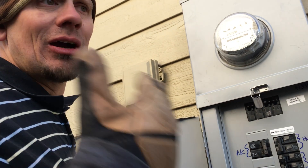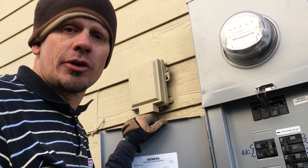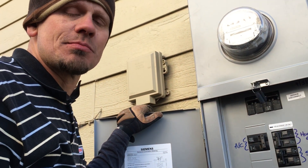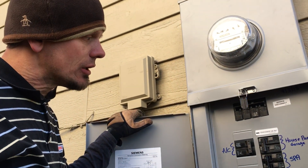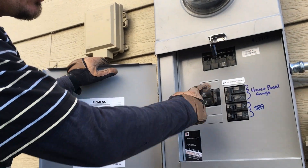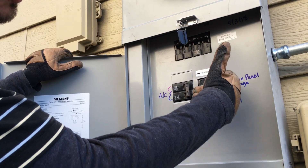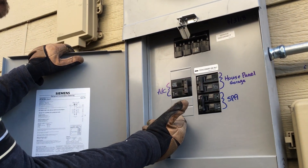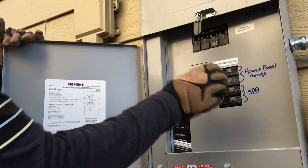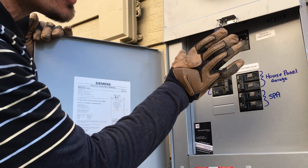The power company said they're not going to let us do 200 amps unless we upgrade their transformer. The other side of it is I'd have to redo and damage their basement pretty bad to get a number four in. So her inspector looked at that. We had 100 amp and only four spots before. Now I've got eight spots, and it also has the tandem slots — what I'd call teeth — so you can actually put quads in there. That basically makes it an 8/16 service panel.